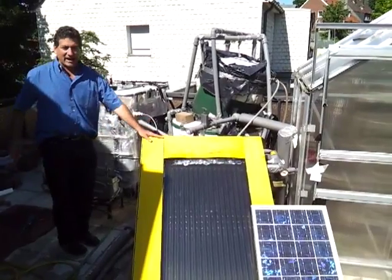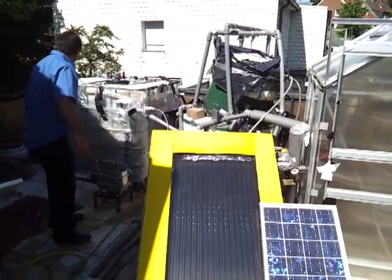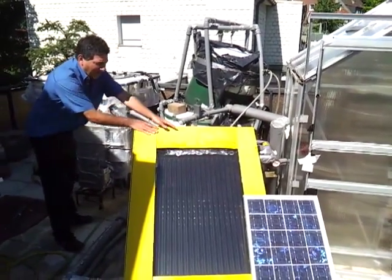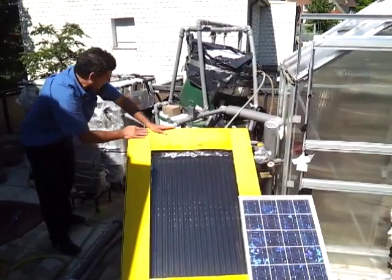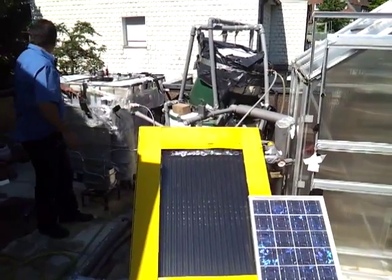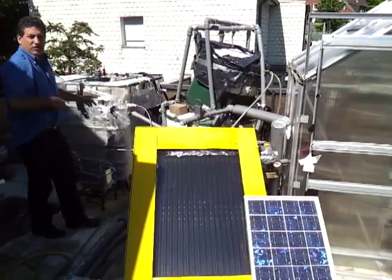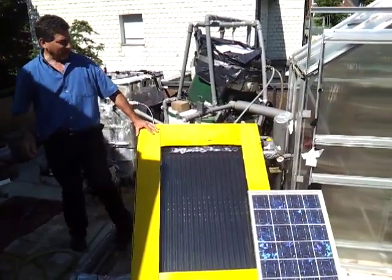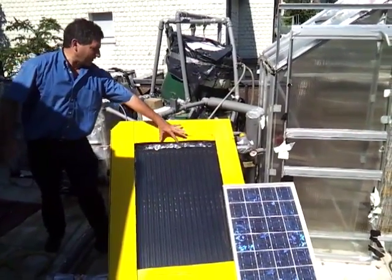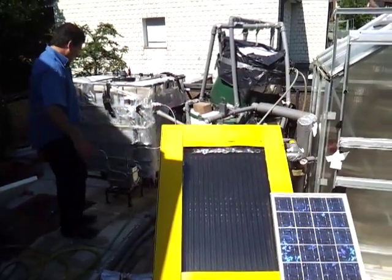Two methods for heating. One is a passive solar system. This radiator in a box of glass is taking the cold water from the bottom of this tank, it then heats it up, and because the top input is higher than the top of the solar panel here, the hot water thermosiphons into the water and replaces it as the cold water comes back in, heats up, and goes in. So there's a thermosiphoning system. It operates every time the sun is shining, and as you may be able to see from this dial, we're now at about 50 degrees centigrade inside at the top of this. So it is thermosiphoning.